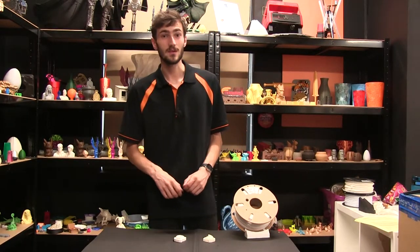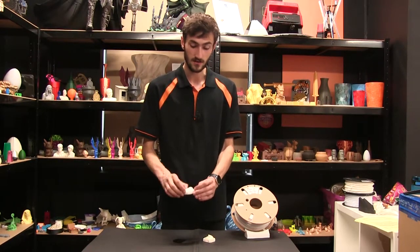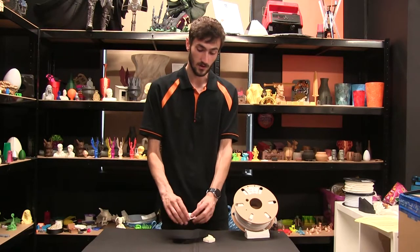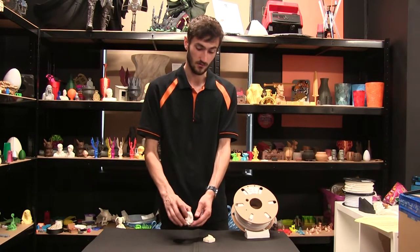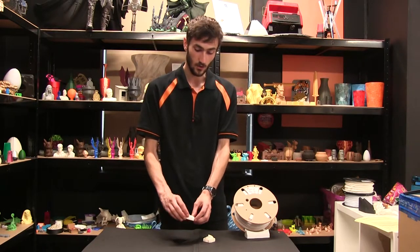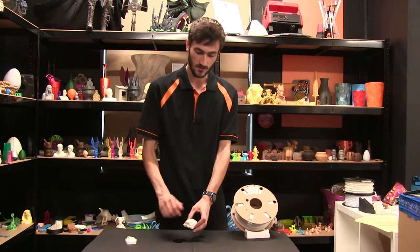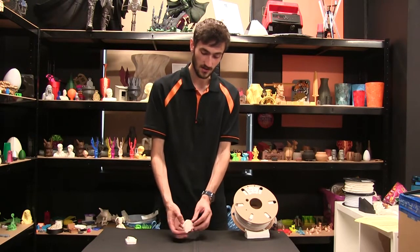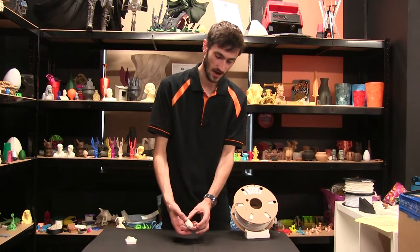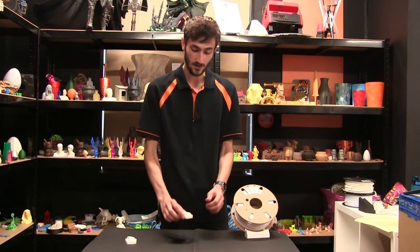We left our demos to simmer overnight. This is the one that was submerged in the bucket of tea water. The back looks really nice, but the rest of the model is almost completely white still. We did leave it completely submerged underwater, weighed down by another tea bag. This one is the one we rubbed with tea bags — it's got a much better result. You can still see lots of brown on the edge and on the bottom. So we're going to be using the rubbing method for our ABS and our PETG.